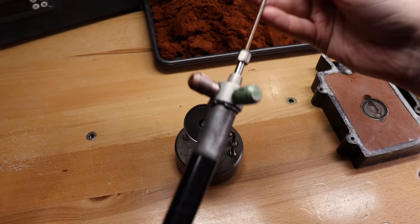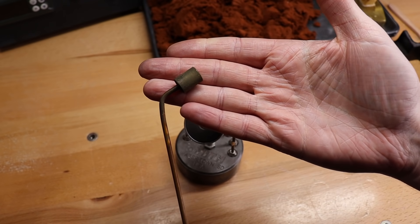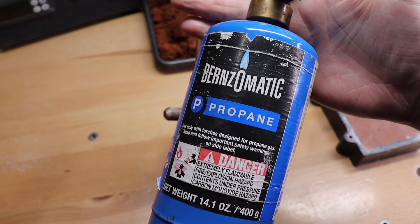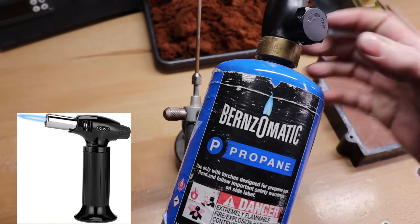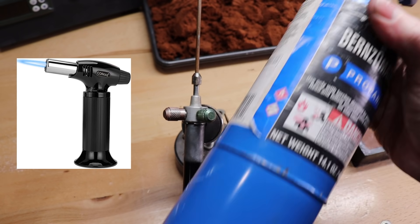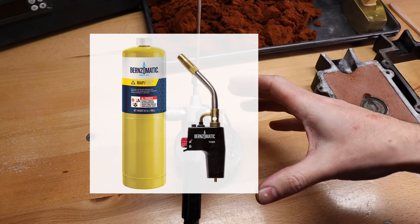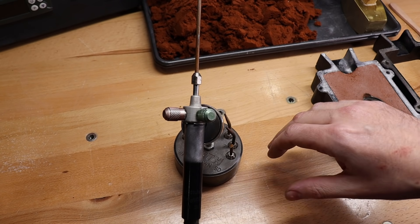For heating purposes, I'm going to be using a Smith's little torch that is hooked up to an oxygen-acetylene setup and has a rosebud tip to basically get it as hot as possible, as fast as possible. So if you only have a small torch like the little tiny ones people use for soldering, they're just not going to work. You can get something called map gas in a similar canister, and this can work on smaller bits — it just depends on what you're casting.